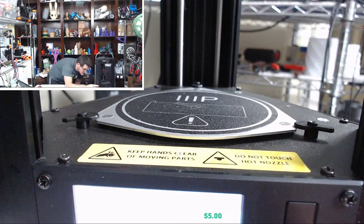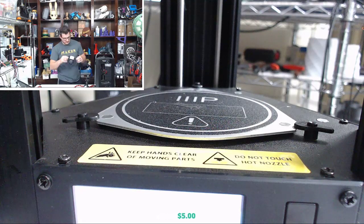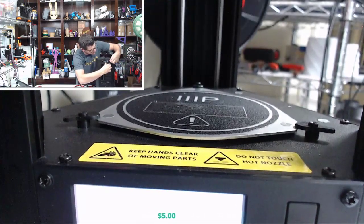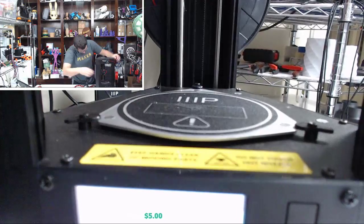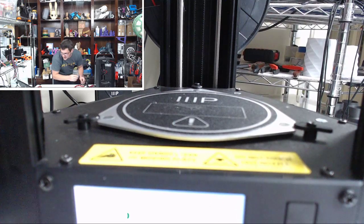It's got a bunch of different things. Butterfly Delta, Superman Delta. So we can probably try their Superman one. I do need some PLA. I do have a wee spool here, some stuff left. This should do. Just feed it in here. That was easy enough. But let's go back and preheat. Up to 205. Get the bed up to 60. And kind of see how long this is going to take.